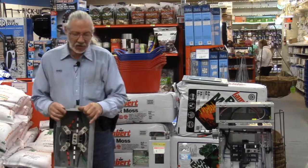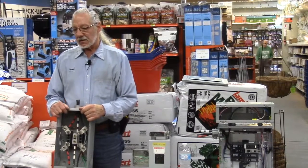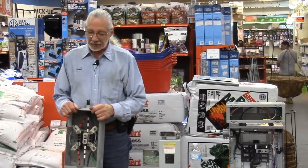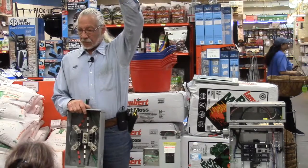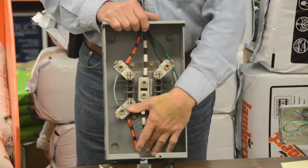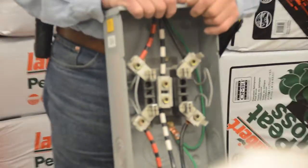And you can see most homes, at least modern, will probably have a 240 volt service coming into it. Some of them are still down to 120, in which case you're going to have to call ComEd anyway and get your electrician and a permit involved. But if you have 240, it'll be marked as you see it somewhere along the line. If not up where it comes in, at least you'll see white tape somewhere. You may see 2 blacks, but you'll obviously see white marks on one of those 3 lines coming into your place. The white is neutral.